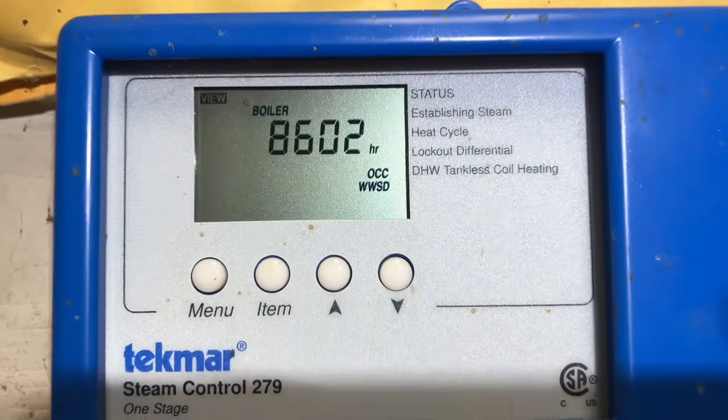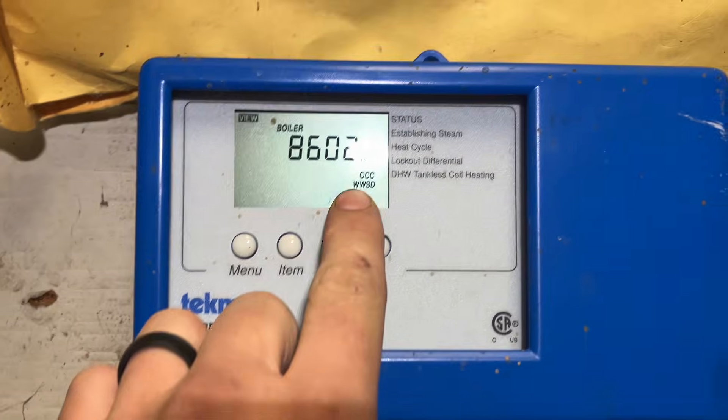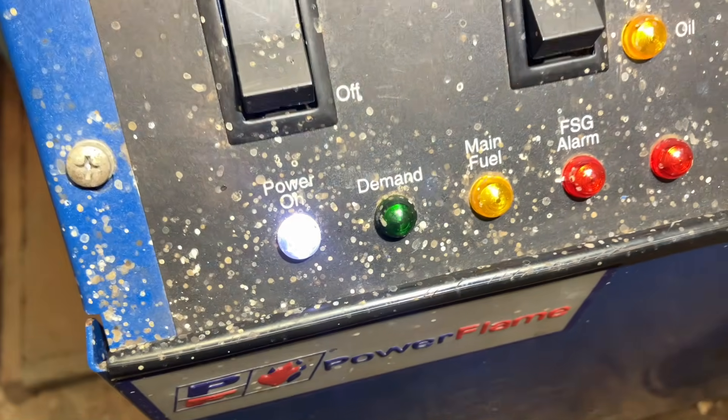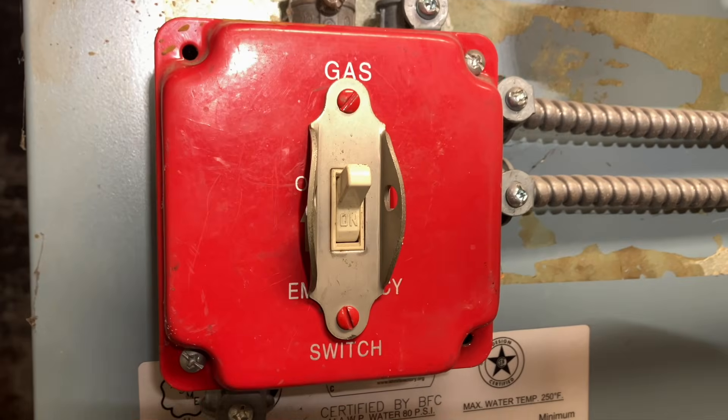This first one's a little embarrassing because I already did the tune-up here and now they have no heat. For starters, that's wrong because it is 40-something degrees outside — outdoor is reading 60. Nothing — gotta be a switch off somewhere. Well, the switch is off.